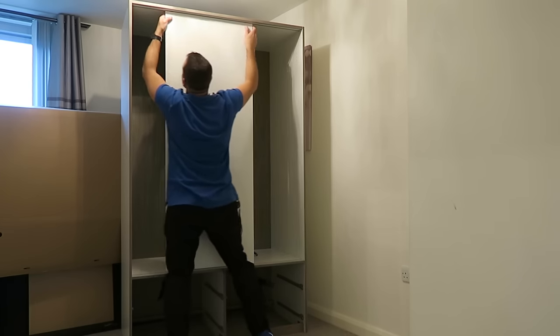We're going to have drawers. This is the front panel for the drawer — each drawer has four screws, two on each side. Secure them in and go to the stopper only, not deeper and not higher, otherwise you'll have a problem with the side panels. These are the side panels — four left, four right — with two wooden plugs on each side panel and two plastic locks on each side panel for the drawer. Place them in; make sure the arrow is in the right direction, otherwise there will be a problem when putting them in. Exactly the same for the other four — four left, four right, don't forget.